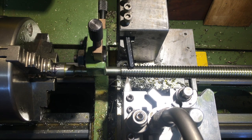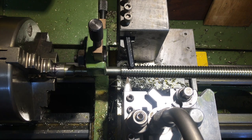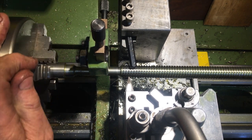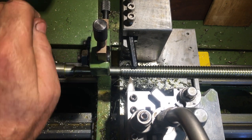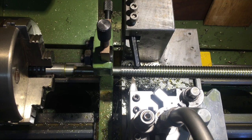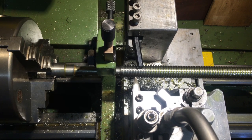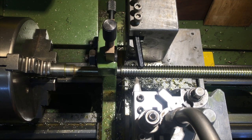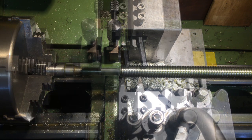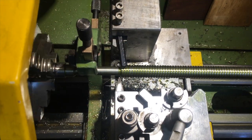To set the full size tool into position I used a combination of cross slide and compound slide to position the tool so that it was just scratching the top left corner of the screw thread while manually turning the chuck. Once a scratch was detected I wound the compound slide back out a couple of thou and worked the chuck backwards. Because of the gear train backlash the tip of the tool then hovered over one edge of the thread crest, allowing me to use a feeler gauge to gauge the tool position. At this point I zeroed the cross slide, moved the compound slide in by the amount indicated by the feeler gauge, and set that to zero. Before winding the chuck back I backed off the cross slide as usual. Now with the cross slide at zero and the compound slide advanced by 0.2 millimetres — about 8 thou — I hit the go button and held my breath.